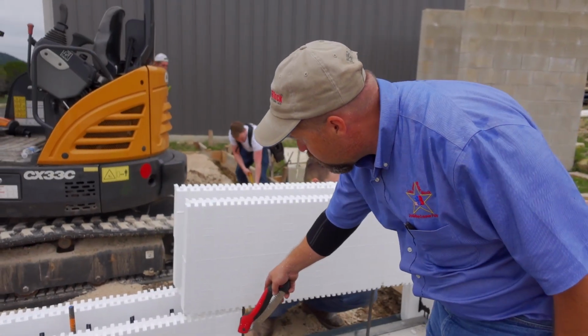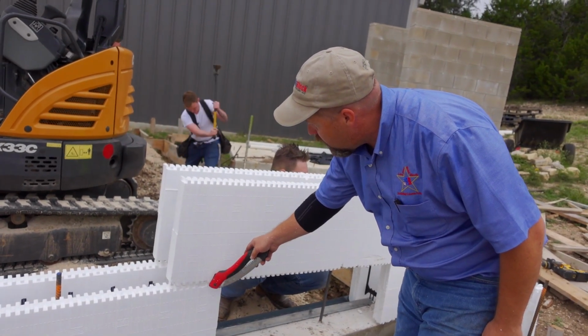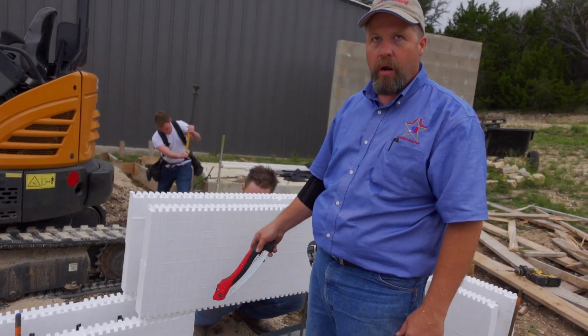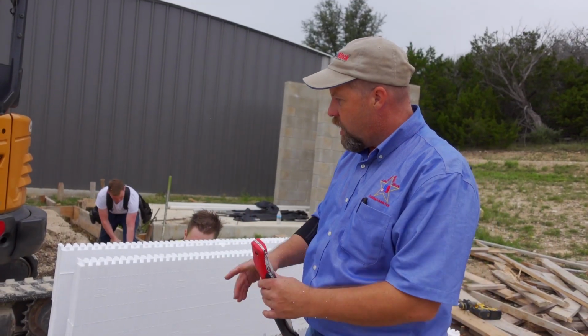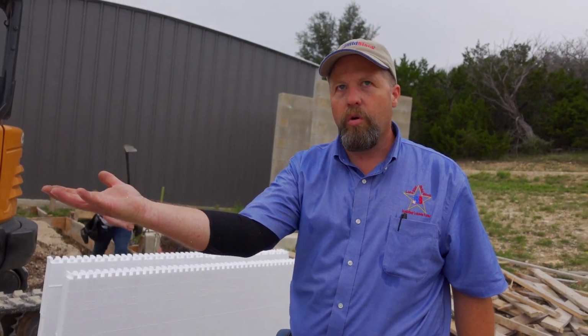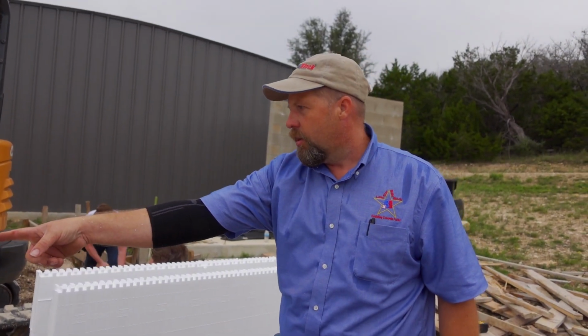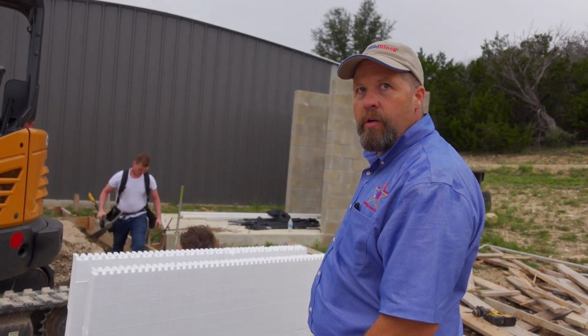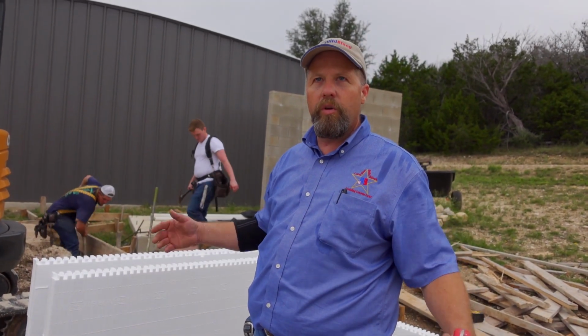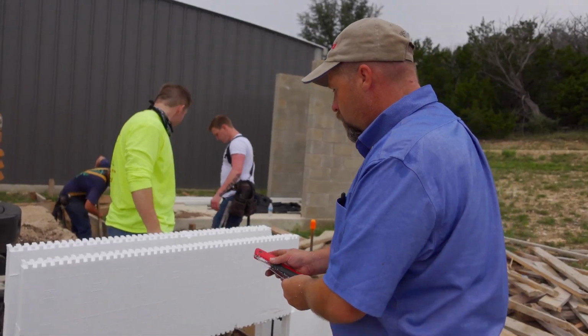You know, you could go ahead and cut these 2 tabs off, and cut these right here and stick it like that. But I still have a common seam, and I'll maintain that seam all the way up, because if I don't, the next row, like I said, we're gonna flip the corner over. Yeah. So that means the short side will be here. Right. So now my lengths are gonna be different. Okay. So after the first 2 courses, we know what the wall's doing. We just mimic it all the way up. So you're just gonna go alternate.